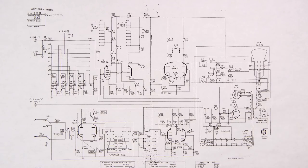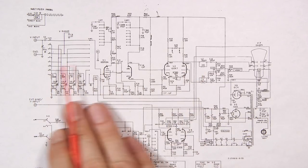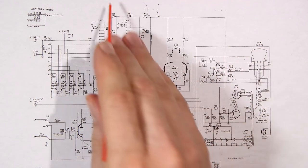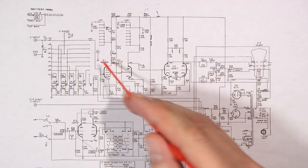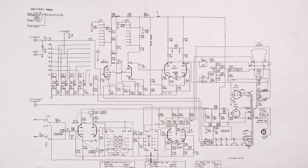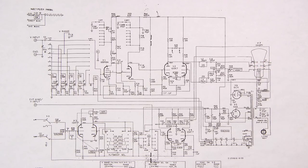Now, nowadays, since they're digital oscilloscopes, you basically don't have this section doing anything in here anymore. You still have a vertical amplifier section. The input to your oscilloscope is still a vertical amplifier. It's just that it's working differently. It doesn't directly drive any plates inside of a CRT.